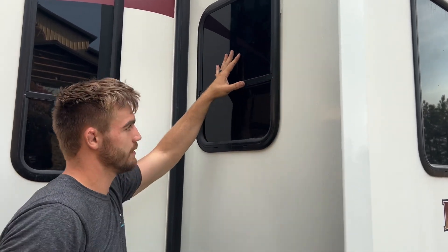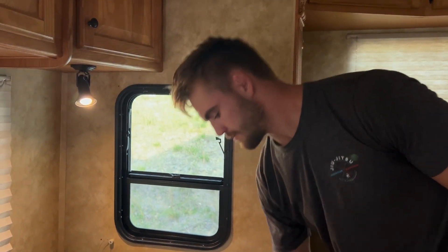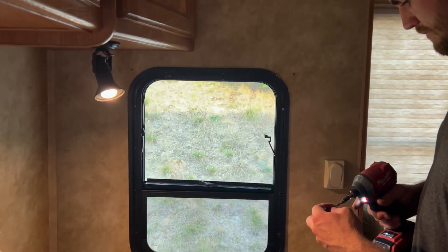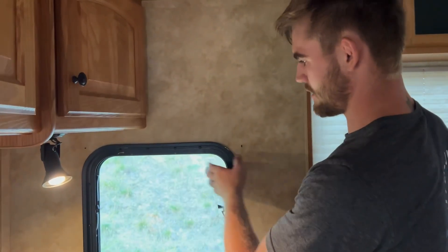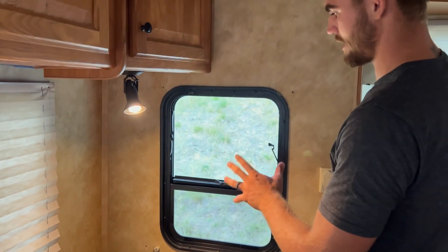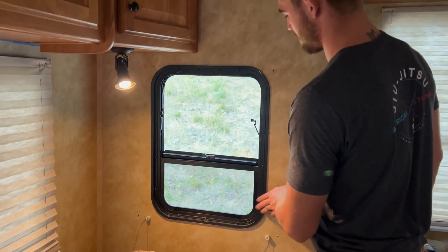You do want somebody to hold it. So now we have one screw in, so Charlie can come in here and we'll put the rest in. Take your cup of screws that you saved from two months ago when you took the window out — it's just a matter of putting those in now. Keep in mind this is like an aluminum frame, so it has a little bit of flex to it. You want to keep some of the first screws kind of loose so that it has a little bit of flex in it so you can line up all the holes. You might be able to mark the holes with a Sharpie or something like that.